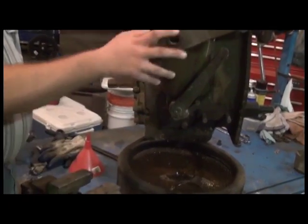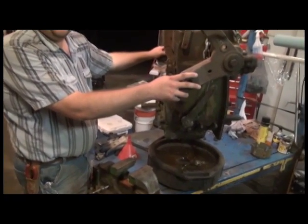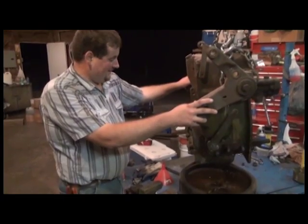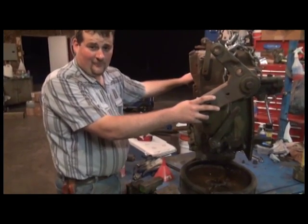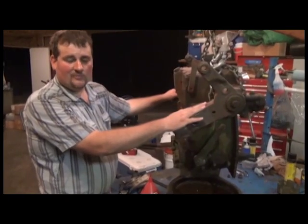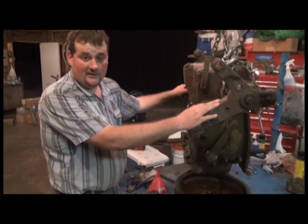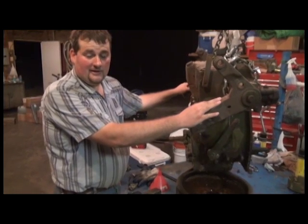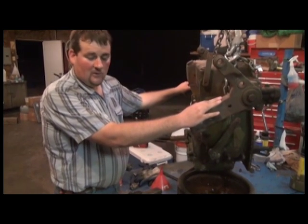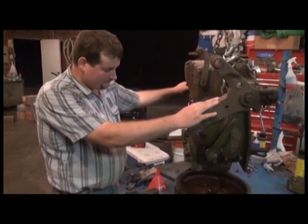If your power shaft clutch is slipping, it may just need adjusting, and probably most of them, like all the tractors out there, could use a good oil change. A lot of the clutches hold about 4.5 to 5 quarts depending on your model, and as always when you're starting a project like this, I highly recommend having your operator's manual, but more than that you're going to need a technical manual, whether that's a factory John Deere service manual or an I&T service manual.